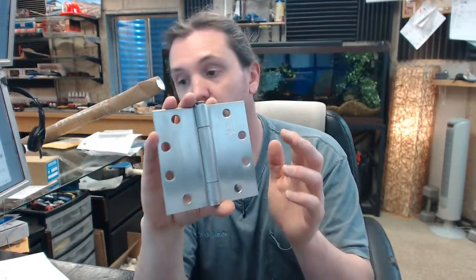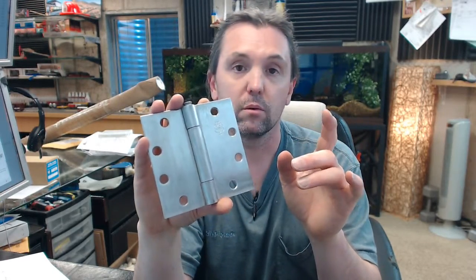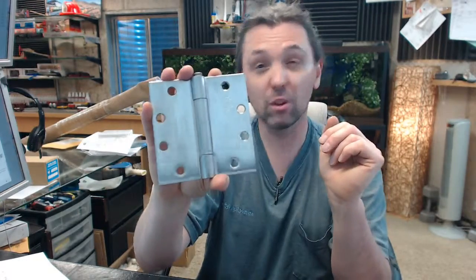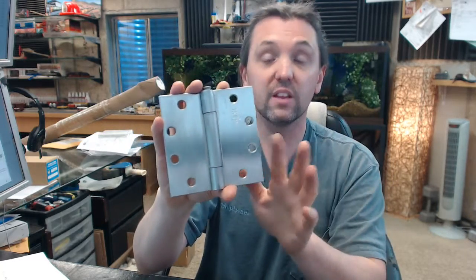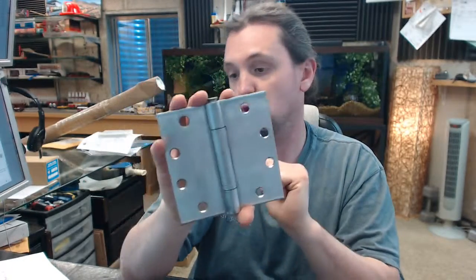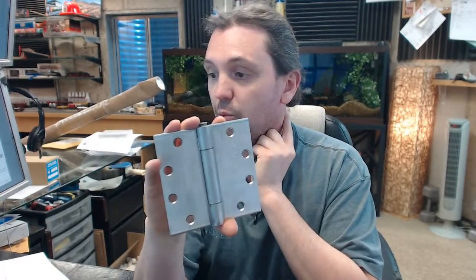First of all you have three columns under the catalog number: steel hinges, brass or bronze hinges, and stainless steel. The 2 means stainless steel as we discussed — if that 2 becomes a 1 you have a brass or bronze hinge, if it is a 0 you have a steel based hinge. 5000 is a five knuckle hinge versus this three knuckle 8000 hinge. If there is no BB or no LB, that means it is a plain bearing hinge — this hinge is LB, meaning the interior raceway has been prepared for ball bearings. The only other notable difference is the 8010, which from the table gives you a wide throw style hinge.